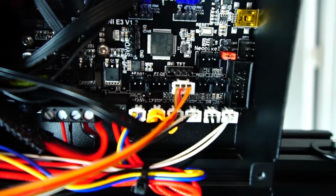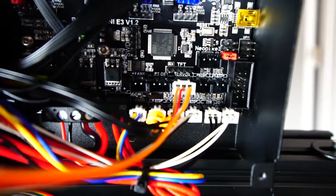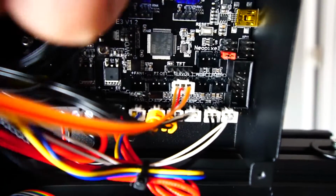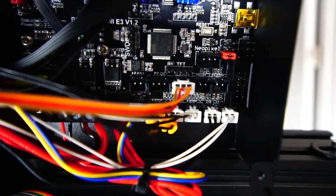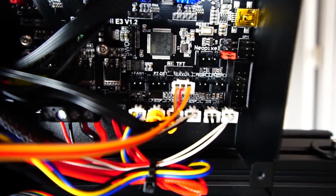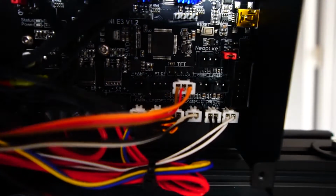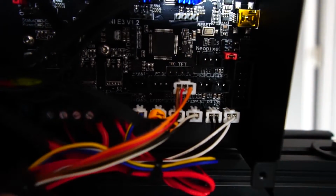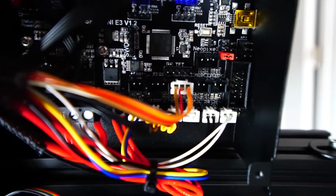By using the BLtouch or the 3D Touch with the Z-Stop, you do have to be careful about your initial settings because if you don't set the firmware correctly and the firmware doesn't know that you're using the BLtouch with the Z-Stop, then it's going to try to auto home at your bottom left, and then as it goes down, it won't know when to stop because there's no longer a Z-Stop to stop it. That's why the settings are important, and once you have those settings correctly, your BLtouch will be the one that controls your Z movement, and you won't have to worry about the Z-Stop anymore. Obviously, if you still want to keep your Z-Stop, you use a different port using the probe, but Big Tree Tech actually recommends using the Z-Stop.